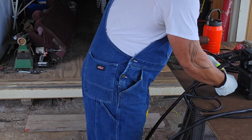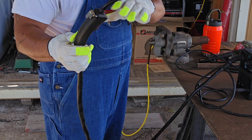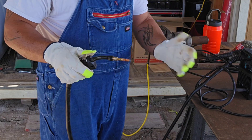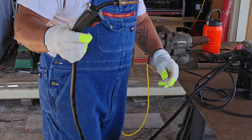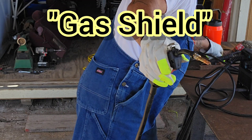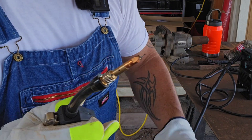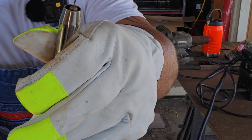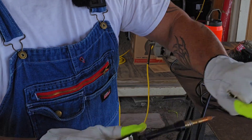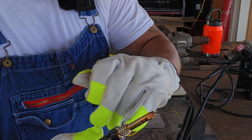I'm going to go ahead and hook the stick welder up — I think I've got some 3/32" rod. We'll just put some steel together, throw a little bead on it, and see how she does. Switch the ground over to negative since we're not on the wire welder. This wire welder doesn't unplug like most other units — you can't pull it out, roll it up, and get out of the way; it will stay attached, which is not a big deal. It does come with the cup but I don't like cups on flux core — it makes it hard to see around. Since this can't use gas anyway, as long as some slag doesn't get in the port, it's not going to hurt anything.